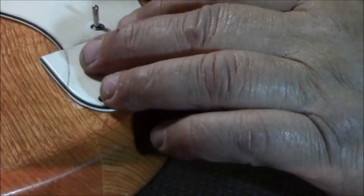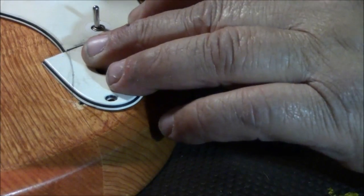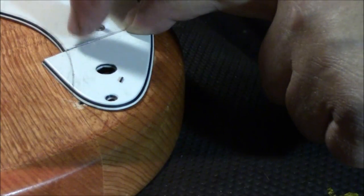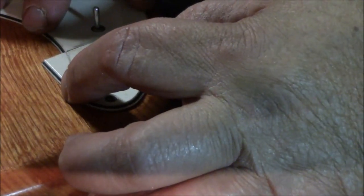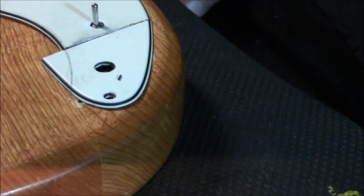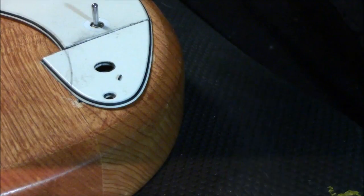What I've done, guys, I took my little protractor out and I followed the curvature of the original piece. And what I'm going to do is cut this at an angle, just like that, once I put it in my vise. And that'll be that. I'll clean all this off. I'll sand these very gently just to get them all level with one another, have a nice straight edge to them, get all the pencil markings off them, and then get the glue out with the filament tape and the aluminum tape and tape it up so it won't go nowhere. Of course, there won't be tape on top of it.